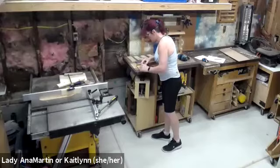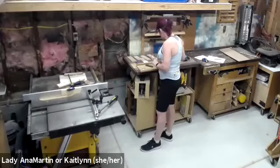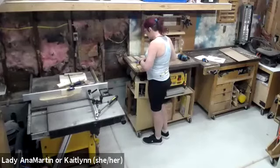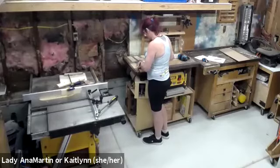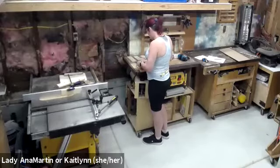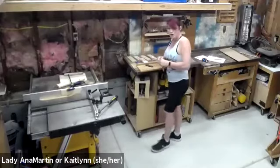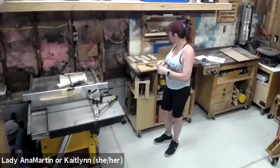If you are going to put hinges on something, you almost always want to make sure that you've got really solid hinges. You can find lightweight hinges at hardware stores, and those really are not going to stand up to the work that we're doing, unless it's something like a jewelry box lid, which is what it's designed for. The best hinge to use for applications where a hinge is appropriate is a piano hinge, also called a continuous hinge.